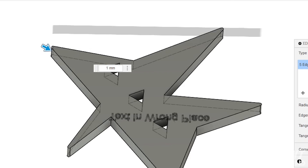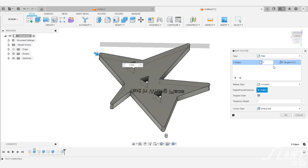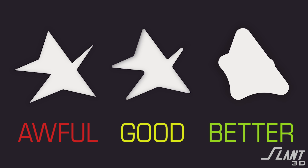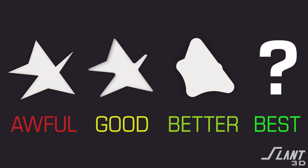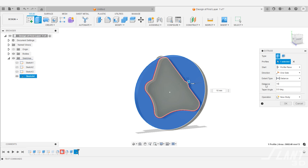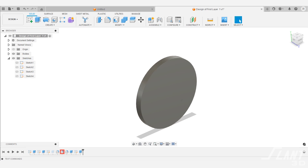What you can do is just round out the corners a little bit, but do the maximum amount possible — the largest fillet you're able to place on a corner, do it. If you can do one millimeter, that's fine. If you can go up to five or ten, do that. Take this down to a round blob. The rounder, smoother, and more circular the first layer is, the better. We've taken this star shape that is absolutely horrible to print and blended it all down to just a circle — now you have no corners at all.